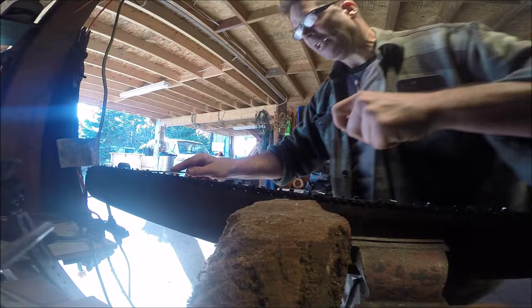This is a good sign — the rakers are appearing again. Before they weren't even in the realm. I'm set on softwood but we're actually cutting hardwood. I know how it was cutting because I was there. The nice thing about hand filing is you can kind of customize to what you're after. I think this chain is done now.